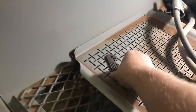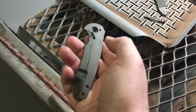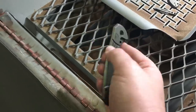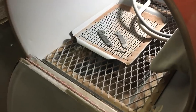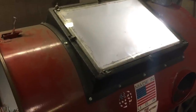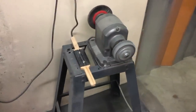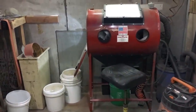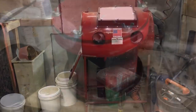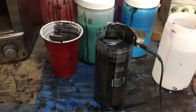I've removed anything of importance that can't get blasted — the lock bar insert, the bearings, all that stuff. If I was doing the blade, I'd have to mask off the lock interface too. After blasting, if we're doing orange peel it would go here, then into anodize. But this is going to be a ceramic and anodize combination, so we'll get into that here in just a little bit.